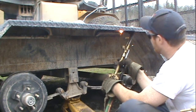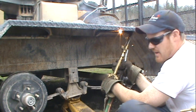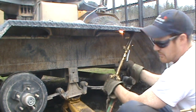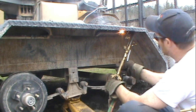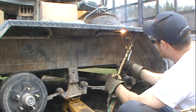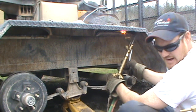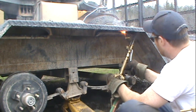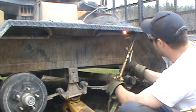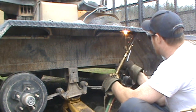The reason I like to use propane is it's one third the cost here in Ontario. A large company closed shop in Quebec that produced the acetylene, so it drove the price way higher than it was. And I always find that I get an empty tank, but I can just grab a propane tank from the barbecue and finish what I'm doing — you can just exchange it. You can get propane tanks anywhere, so it's not a big deal. Whereas with acetylene you have to go to the actual depot and you have to rent the tank.